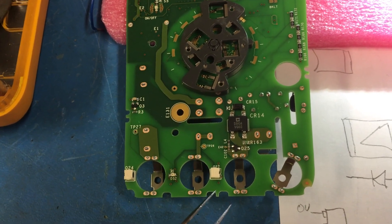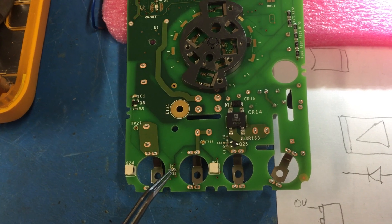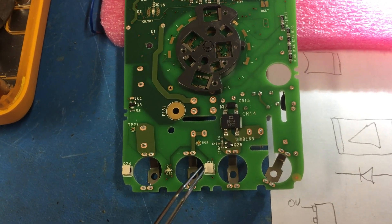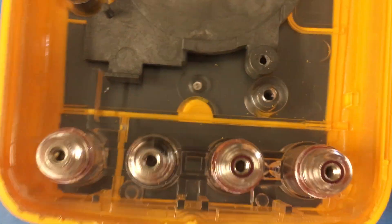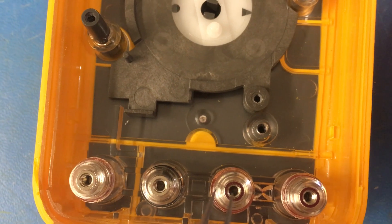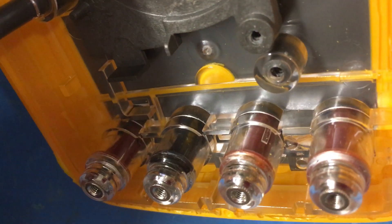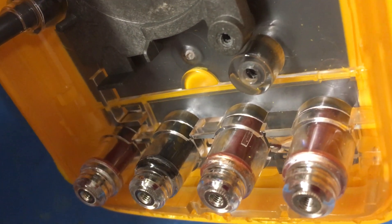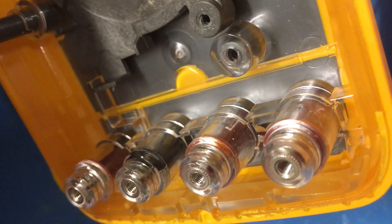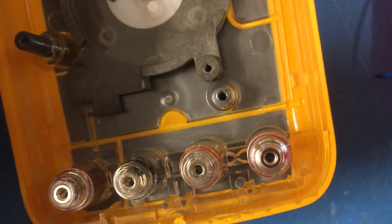One thing to note: you cannot test it with the PCB out of the case. The reason is they use a light guide in the case — the light guide takes the infrared, which is emitted upwards with about a 120-degree viewing angle, and deflects it sideways to the two receivers. If you look inside the case you can see the light guide at the bottom. There are actually shrouds on the inside, and if you look very closely there are small holes through which the infrared passes to the photo transistors. When you plug a shrouded lead in it blocks those holes, and that's how it knows the leads are plugged into the ammeter inputs.